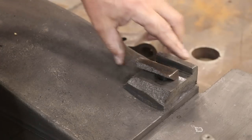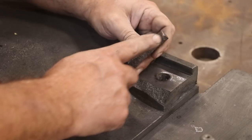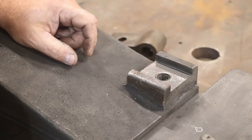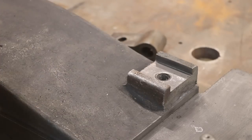That's the game plan. I'm going to start by cleaning up the castings along the break, put some bevels in there to give room for the braze to go, get everything set up, start putting some heat in it, and braze it back together. Let's do it.